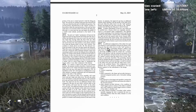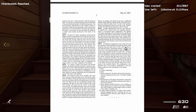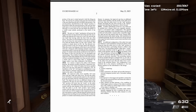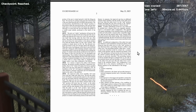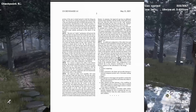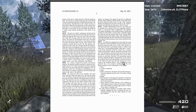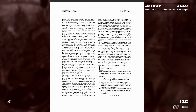Moving forward, an additional configuration of the safety lever and sear element to create interference and prevent release of the firing pin when the safety lever is in the safe position is also disclosed. Here he improves the safety lever itself where a protruding element is added to the safety lever. This protruding element, rather than a notch as previously described, would be rotated into a position which would interfere with the rotational movement of the sear, preventing the sear from moving to the release position. You'll have to change the whole slide to do this. This protruding element would be installed through an enlarged hole on one side of the serialized chassis and sear housing, or attached to the safety lever pivot pin after the safety lever is positioned in the serialized chassis.